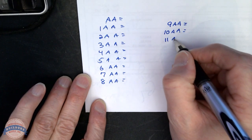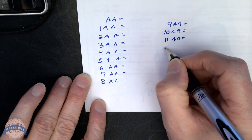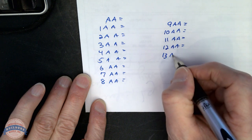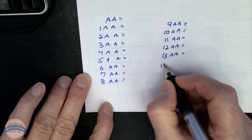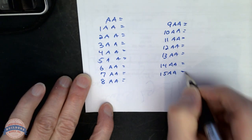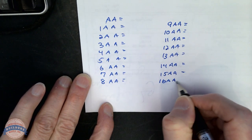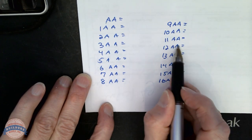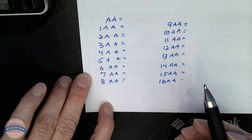Someone can look at that and say, oh, okay, well, it's a level 2 system. It's a level 2 system because numbers come before letters. That's how we know it's a level 2 system. So, our master is AA. This is the 12th change key under the AA master, is how that would work.